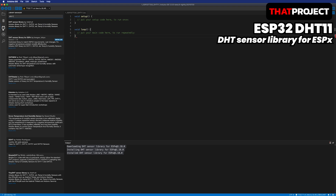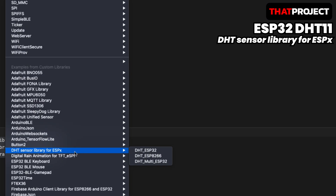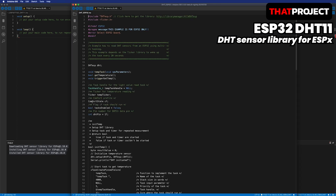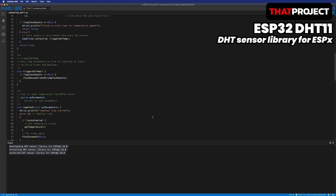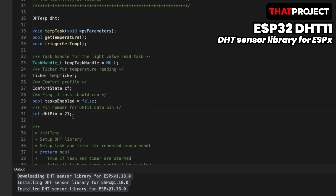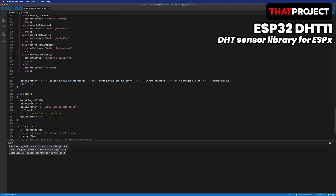After installation, you can load one of the examples from this library. I'm gonna use the DHT ESP32 example. I'll copy the entire code and paste it into my project. The characteristic of this code is that it operates based on the task of FreeRTOS, calling the getTemperature function every 20 seconds to get the readings from the sensor. I will update the pin number connected to DHT11 and upload it to ESP32.